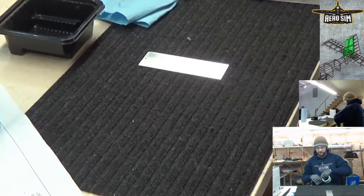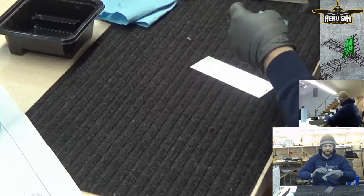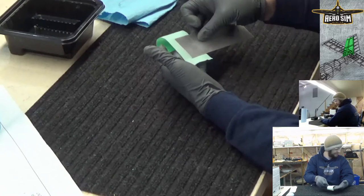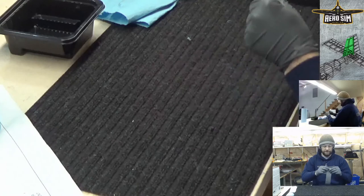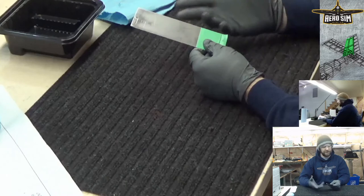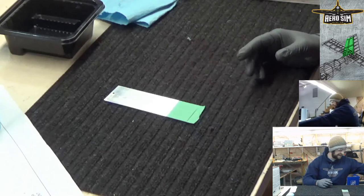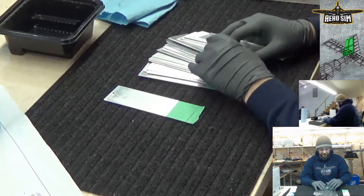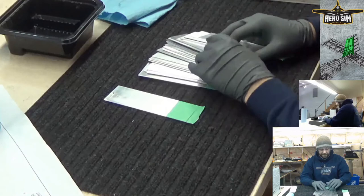Before painting, I tape off just the bottom section of each slide to leave it completely clear of paint. That becomes our reference area. After we paint and remove the tape, we'll have a painted area up top — where we can put scratches and gouges — and a bare reference area at the bottom to compare. Here are some I prepared earlier; you can clearly see the scotch-brited area stands out compared to the shiny untreated section.